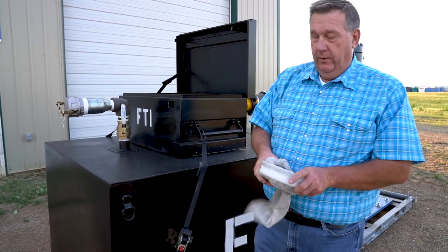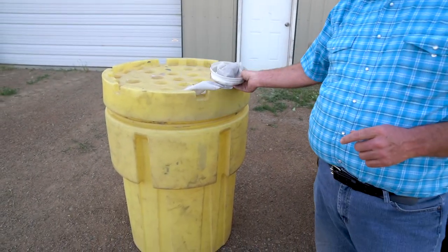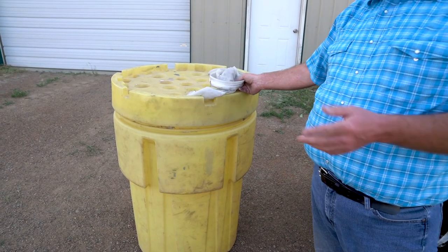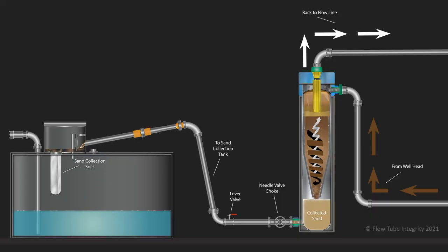When the sock is full, we simply put it into one of our containment vessels. This unit can stay on location for an extended period of time and wait until there's enough to make a trip to the disposal, reducing the cost of back-and-forth trips. Any extra fluid discharged with the sand is collected in this tank. When the tank is full, the same truck taking off a load of produced water can simply stop here, empty this tank, and take it to disposal — cutting down on the frequency and cost of trucking.